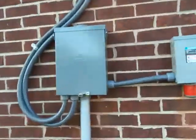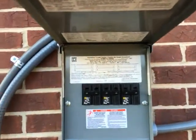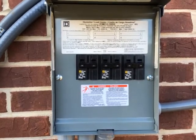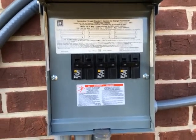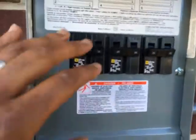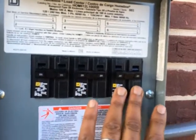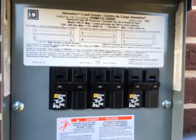Anyway, it looks great — eight panels, 2,000 watts. We've got a load center here; think of this as an AC distribution panel for all my AC circuits. Array number one, array number two, and array number three — each one of these represents a different array with micro-inverters installed.